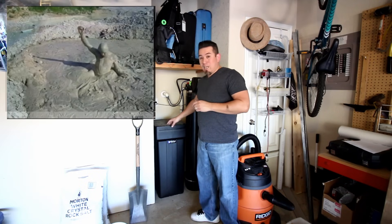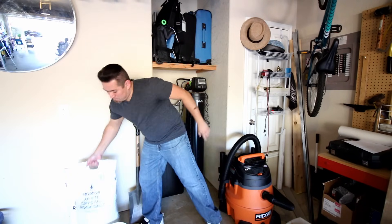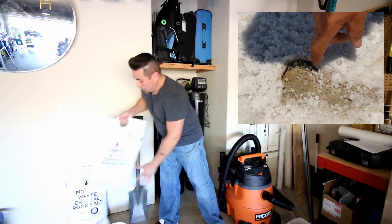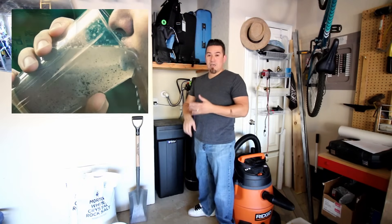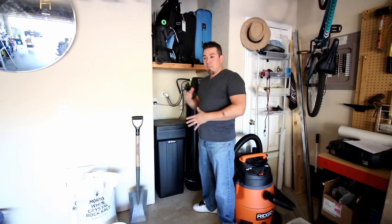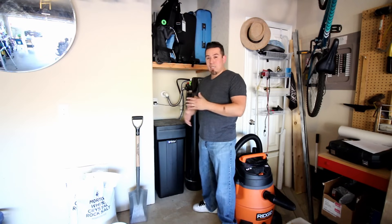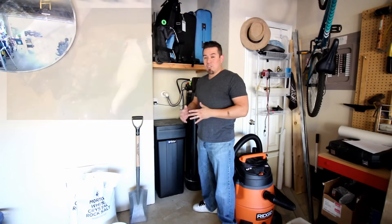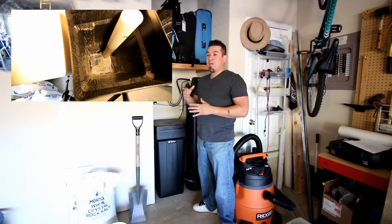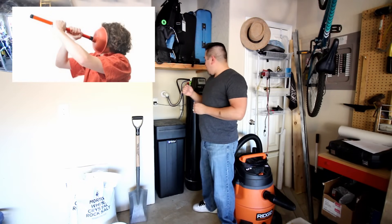Salt is a mineral and there's also dirt in here. You're going to find dirt, contaminants, and other things. What happens over time is you're adding salt to the brine well and your water softener is dissolving that salt to clean the resin beads. What stays behind is small amounts of sediment, and over time that sediment accumulates and starts to look like sludge. It's not the end of the world, but it's a good idea to clean it out so it doesn't clog up your system.